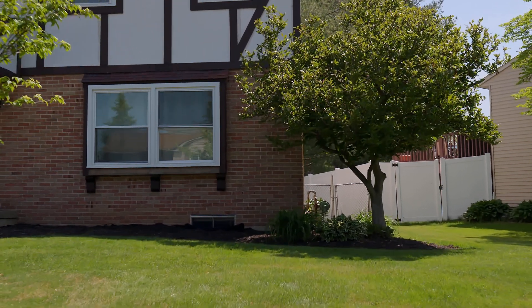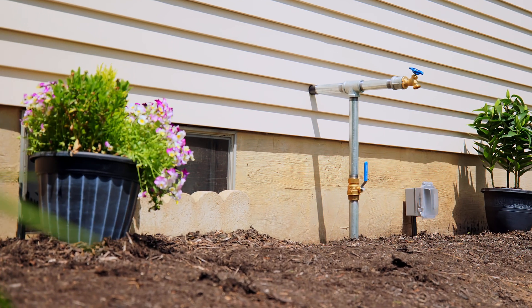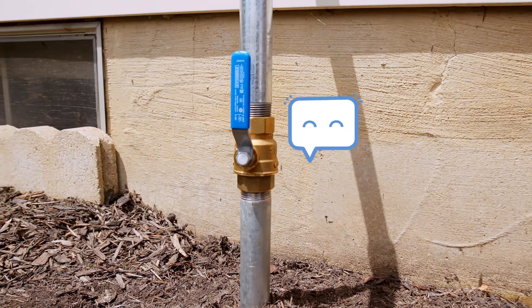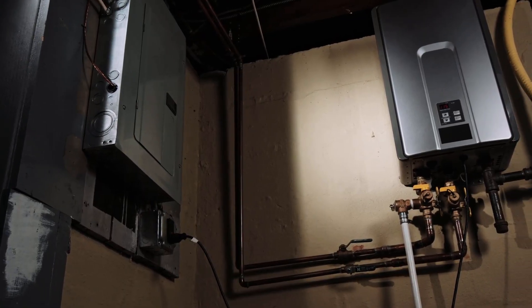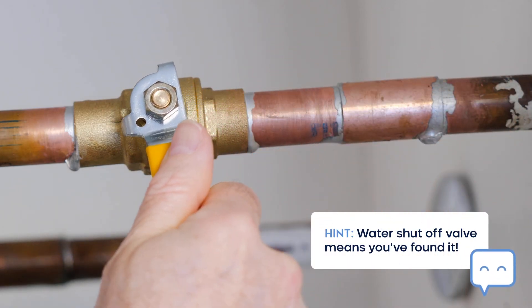A big clue is to find your water main shutoff valve. This is a valve with a long, sometimes yellow rubberized handle on the outside where your water line enters the house. Well, look at that — you found it! But if you can't find it outside, other great places to locate your water main are before or after a water softener or purifier on the inside of your house in your basement. Once you find that main valve, you're in the right place.